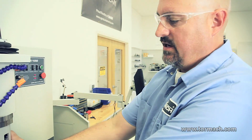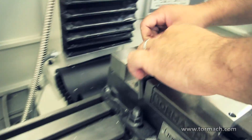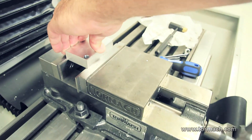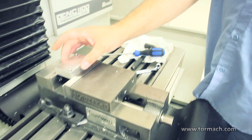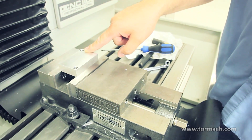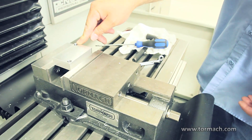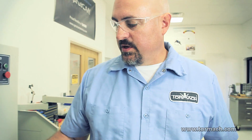Now that we have the speeder head loaded, we can pick up the workpiece zero. Depending on where you get your zero — for our mold plate here — you can either sweep one of the dowel pin holes, so when you go to do the other half of your mold you can sweep the same hole, or you can sweep the center. The speeder spindle is not going to be directly in line with the machine spindle, so if you were doing a roughing operation with the machine spindle before putting the speeder in, you have to re-indicate your piece and pick up your zero with the speeder head.